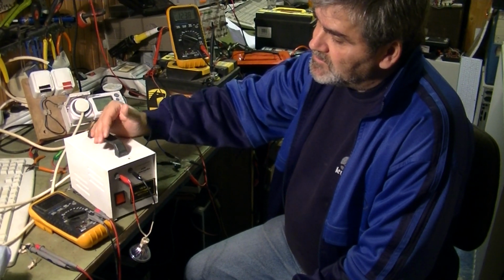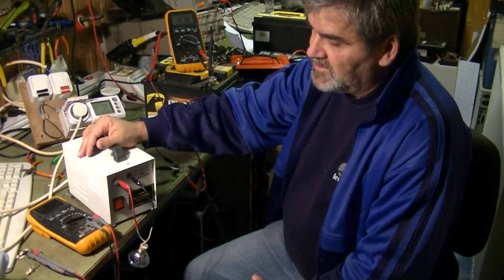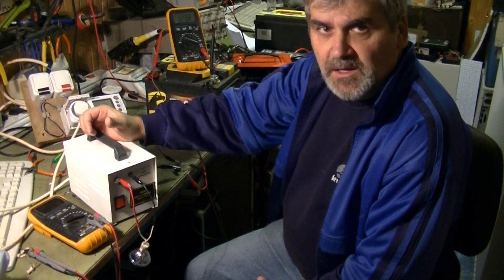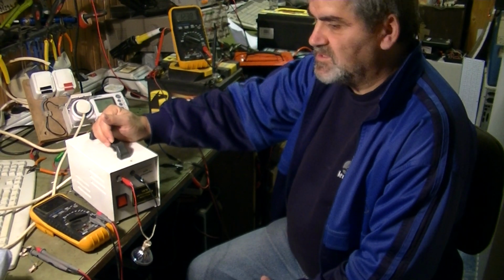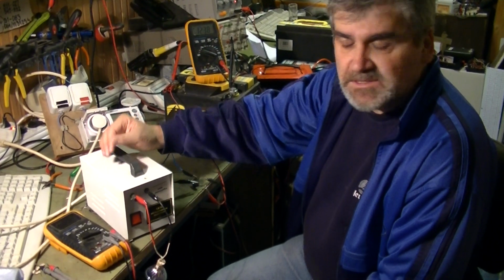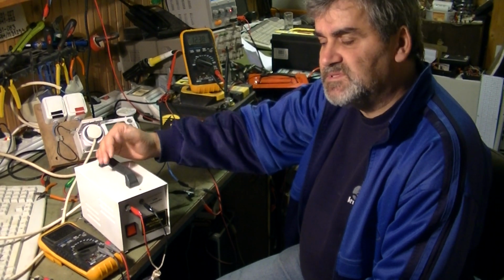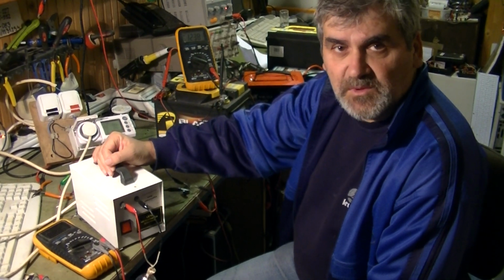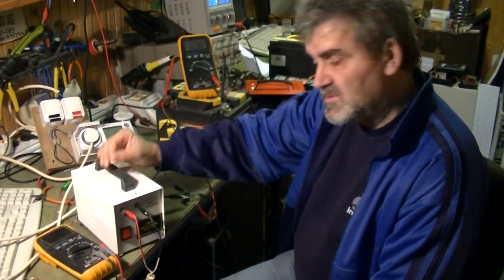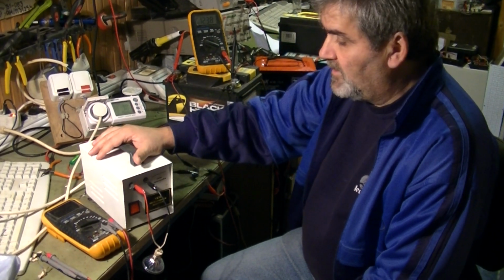To explain, if you have a single cell with one type of electrolyte, and the cell draws 1 amp from a 2 volt source, it gives you 2 watts. But if you put in another electrolyte where the cell draws 1 amp at 6 volts, it will give you 6 watts. But the amount of gas will be the same, because in electrochemistry the number of coulombs is important, not joules.